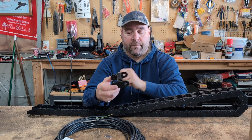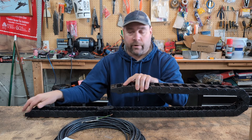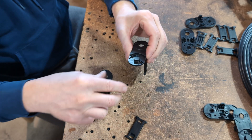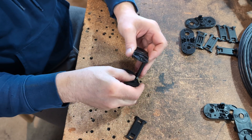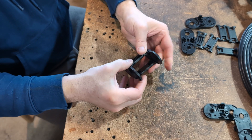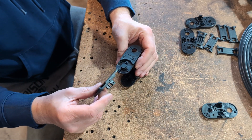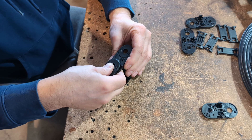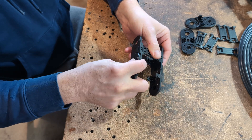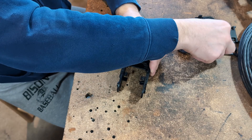So how does cable chain work? It's just made up of a number of links. There are end pieces for each end to bolt on. You take it and snap each one together — make sure you've got the same ends matching the same way. There's a left and a right on them, so that one snaps and it's going to move this way, ensuring that when you put the next one on they both move the same direction.